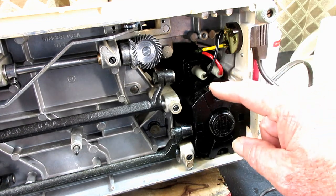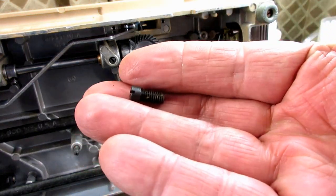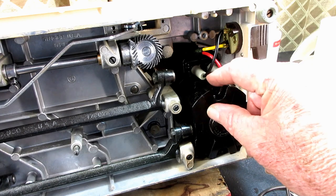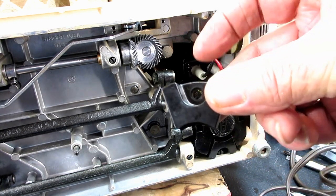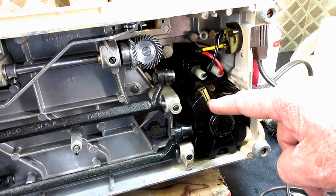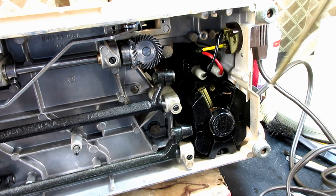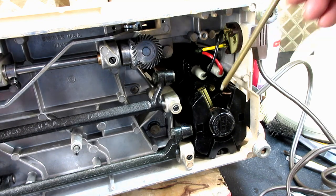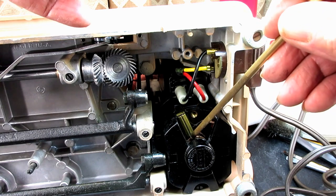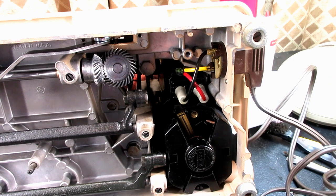There are two little pieces of Bakelite plastic called brush covers. They're held on with a small screw like that — just a cover plate. If you take that screw out you can remove this little pie-shaped cover, and that will give you access to the brush, right here in this tube. Right in here is the copper commutator, which the brush is pushed against, and that's what I'm going to clean up to increase the speed of this motor and improve its efficiency.